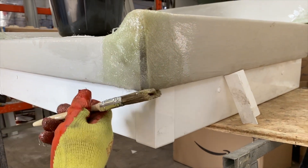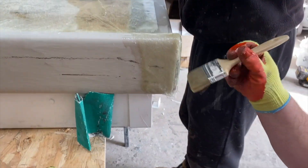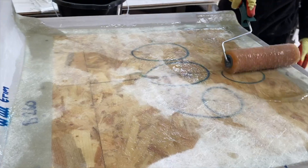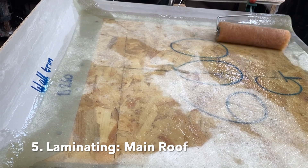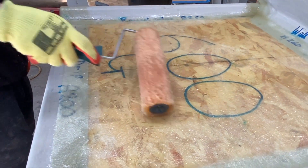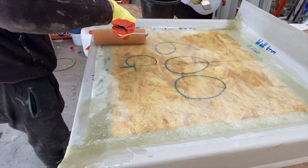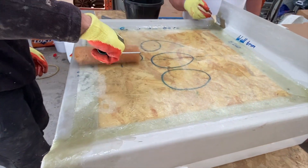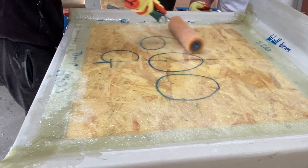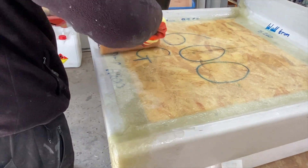The aim is to get a neat, uniform and consistent finish across each of the laminated areas. When laminating the main decking part of the flat roof, place the sheets over the areas you intend to work on, then use a roller to apply catalyzed polyester resin to the matting. Multiple roller cycles are applied to saturate the matting. You should expect to see a color change — the matting turns from white to an almost see-through, slightly brown surface, and the timber underneath becomes clearly visible.